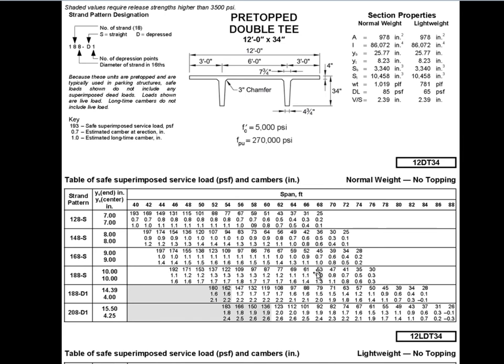We've talked about steel I-beams working in composite action with a concrete deck and the problems involved: shear studs must be welded to the top of the beam, concrete must be poured in the field, and the steel must be fireproofed. In the case of concrete, we have a technique where the deck and beam are cast as an integral unit — the double T. This particular one is twelve feet wide and thirty-four inches deep, with lots of reinforcing steel at the bottom of the stem and concrete at the top as the prime compression element. It's a very nice integrated system with composite action between the decking and the stem.